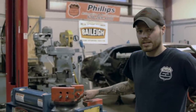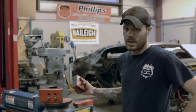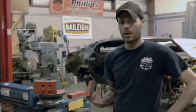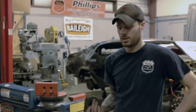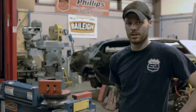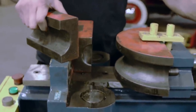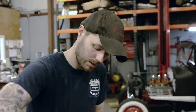We've selected the orange bending die and pulled out the orange followers. You'll notice there's two large followers and one half follower, also referred to as shoes. This would be a half shoe. You use the half shoe when you have to make two adjacent bends opposite of each other and you can't physically fit it in the machine because the other shoe is too large. Once you have selected the proper die, you locate the die by dropping it on and just sliding it in. It will then be held in place by the keeper. The shoes are pinned and there's holes for easy alignment. You will have a left and a right — you can't put them in the wrong spot. Slide them in place.